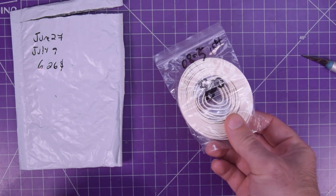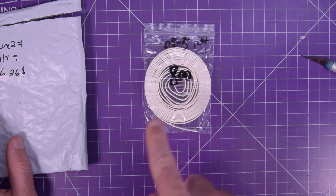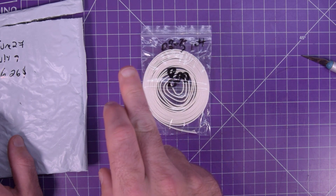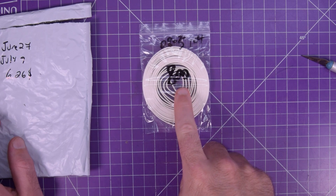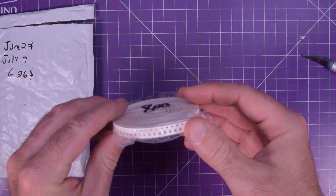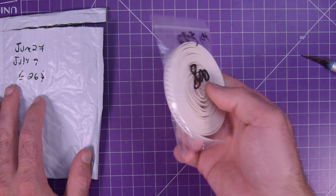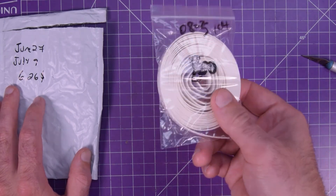These are the capacitors you need if you're going to work with Neopixels, which I intend to work on. There are some new types of Neopixel-like LEDs which I intend to play with, and this is going to be nice since I only have 100 of these 104s in stock and I've already used some. So even if I want to make a board with 100, I'll still need more — might as well refill in 1,000-off quantities. These are 0805, which I believe is just about right for hand soldering — small enough that the pads don't get in your way. 0603 is still doable by hand, but for most of my viewers, 0805 is the limit.